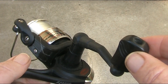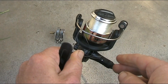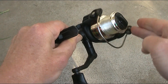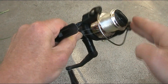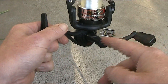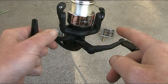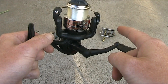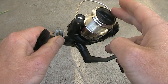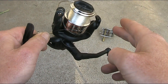So for every 4.7 turns of this, you get one turn of this. That has a lot of potential for radio, because if you think of it the other way — you turn this end, you need 4.7 turns of it for one full turn of the handle. With a variable capacitor, which normally has only a half turn of travel, just over two turns of the handle gives you half a turn of the variable capacitor.